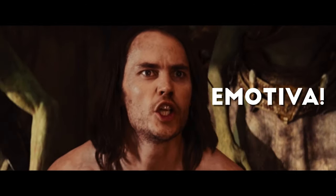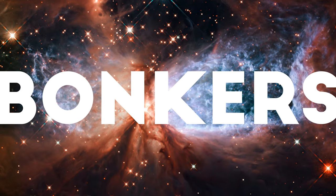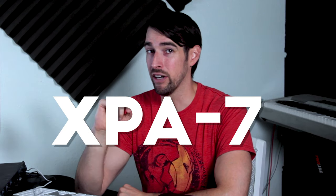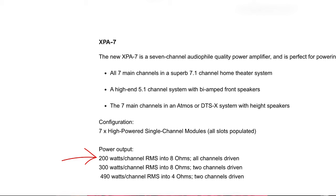A dedicated external amplifier has significantly more power, since it has its own housing, not needing to cram those normally bulky transformers with any other electronic components. I am not being paid by, nor is this video sponsored by Emotiva, but as of right now I've got my eye on their line of cinema processors and amps. Because when you get into this tier of high-end home theater components, things get real expensive real fast. But Emotiva have somehow figured out a way to combine audiophile quality home theater components at a price that's not out-of-this-world bonkers. Speaking of power, their XPA-7 amplifier, for example, when all seven channels are driven, outputs 200 watts per channel into 8 ohms. But then it even tells you right below that it outputs 300 watts when only two channels are driven — not beating around the bush, they just tell you right up front.